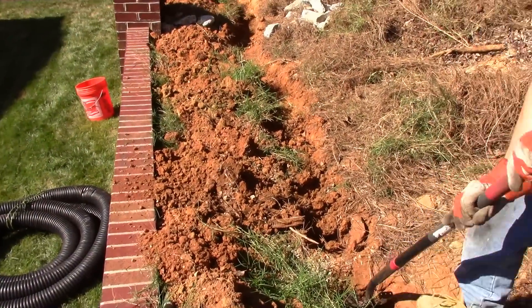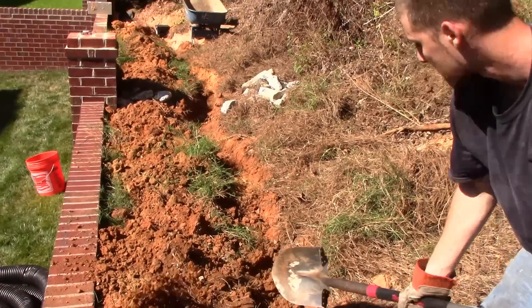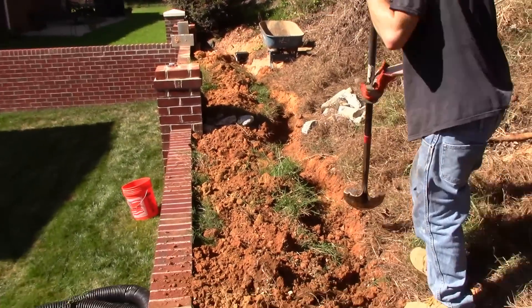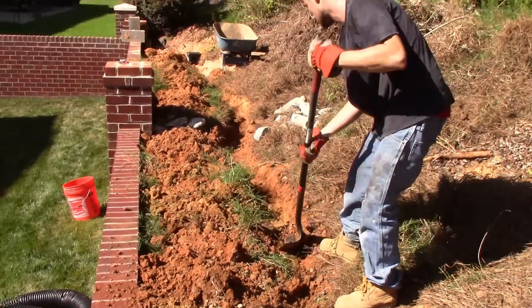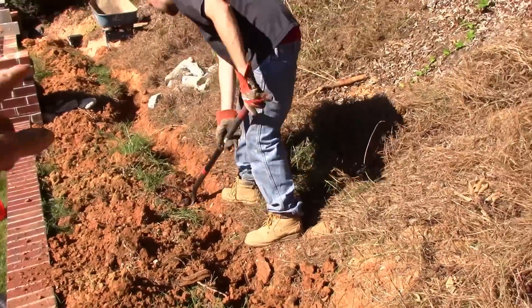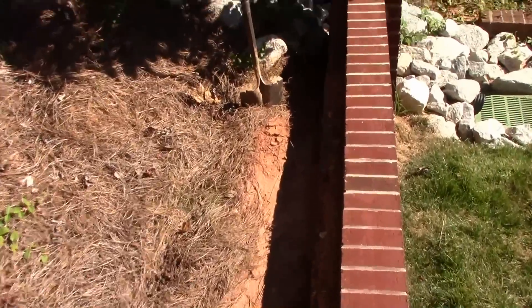You can see we make pretty quick work — two guys dig a little trench, straighten it up a little bit, put a gravel base down, perforated pipe, more gravel, one, two, three catch basins down here, turn and go right into that basin.